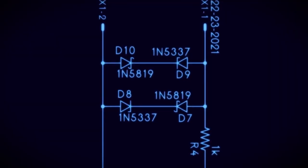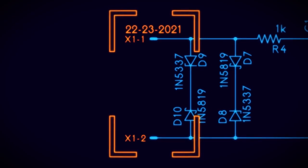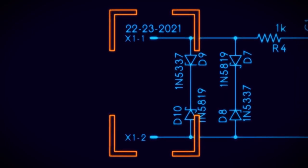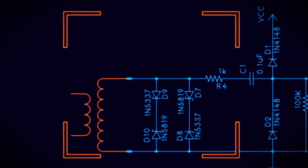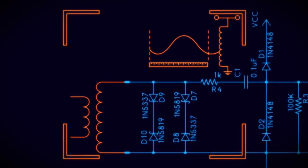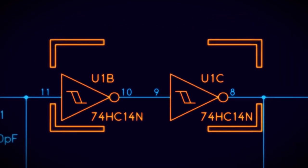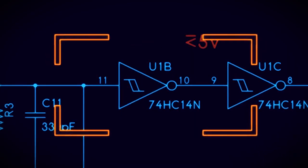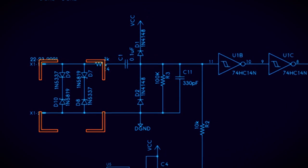Now, what this is, you can see on the schematic while you're doing that. The diodes are set up to clamp what's coming in here. These are glass. Yes, they are. For what I'm running here, we're putting a current transformer on the secondary coil connection to ground, so we're directly sensing the waveform coming off the secondary. So we're getting the resonant frequency of it. And feeding into our electronics over here, we don't want to put more than 5 volts, so these are 4.7 volt Zener diodes, and we have a Schottky.